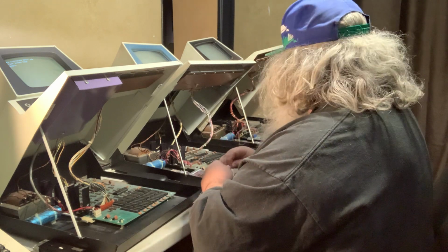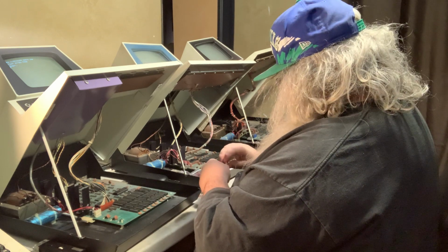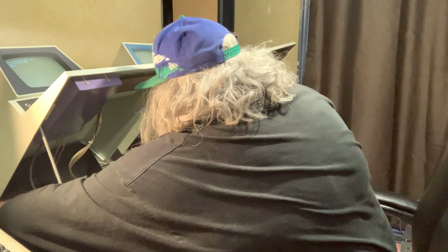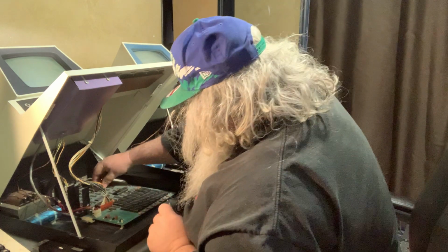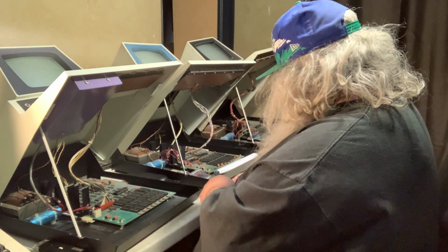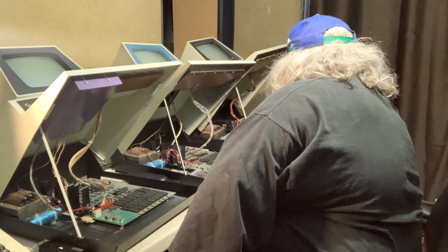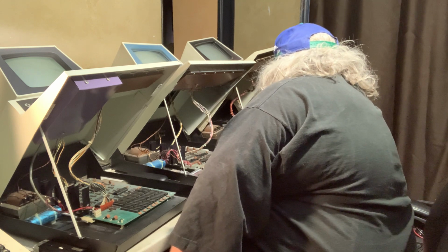Okay, and I have a bag here. I put the good ones in to the screen RAM there. I have a bag for more good, Dusty, Rusty, and Crusty. Okay. Out we go. Okay. Good. Get in the bag. Pop out another chip with great care, going from both ends just a little bit. That helps pins from getting bent.